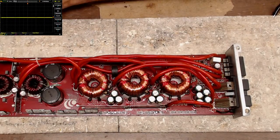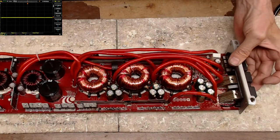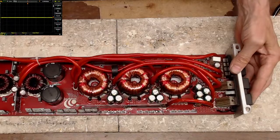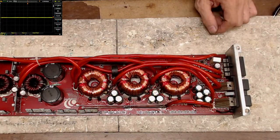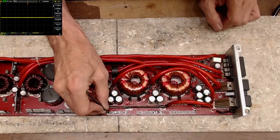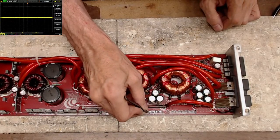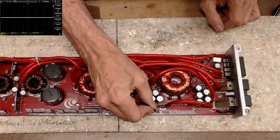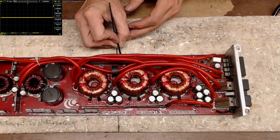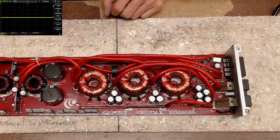All right, there. The power supply is all cleaned up. Gate resistors are removed. All the burnt up transistors are removed. I'm not seeing any burnt PCB, surprisingly. Let me just do some picking here real quick. No, the PCB itself didn't burn up, so no carbonized board anywhere. Which again, you guys will see on the scope if you have any bad areas that have carbonized board.